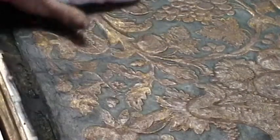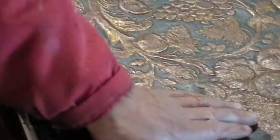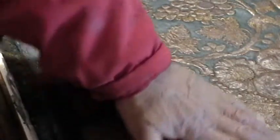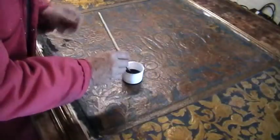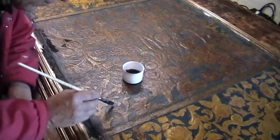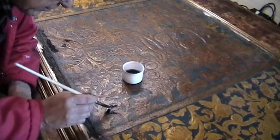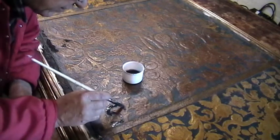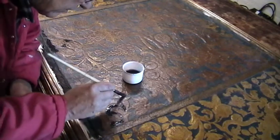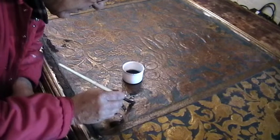What I'm going to try and use is a new substance which is similar to pitch, still flexible — it has to be flexible — similar to a PU-type paint, for want of a better word. The solution in here we'll apply with a brush; you're literally just filling the nicks. Try and keep away from the edges so you're not going to detract from the gilding work. This is all you've got to do — you're covering all these little nicks up so that you have a complete background.